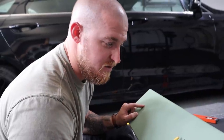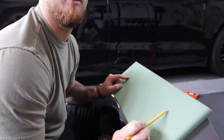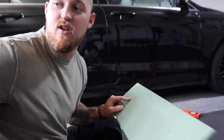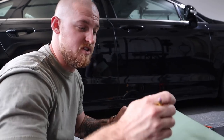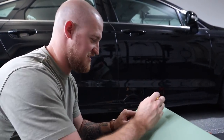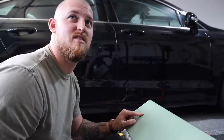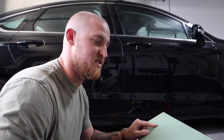After filling in the holes, I cut the distance in half and on the other drawers I squared everything out, got my measurements sorted. Now I'm going back in doing the measurements, then drilling the hole, putting the knob in, and throwing the drawer back in. We're good to go — Nolan's going to have his dresser!